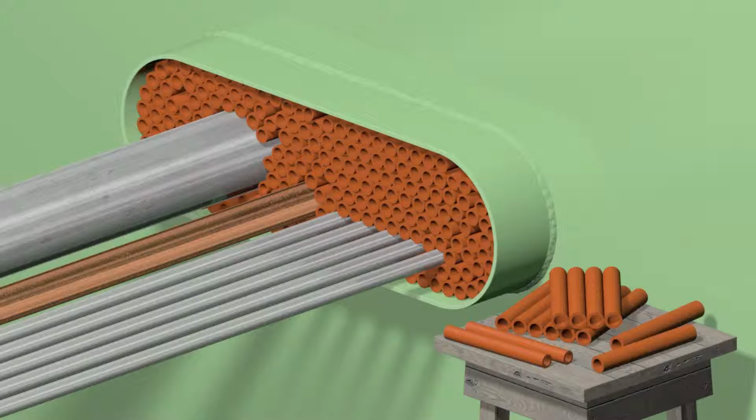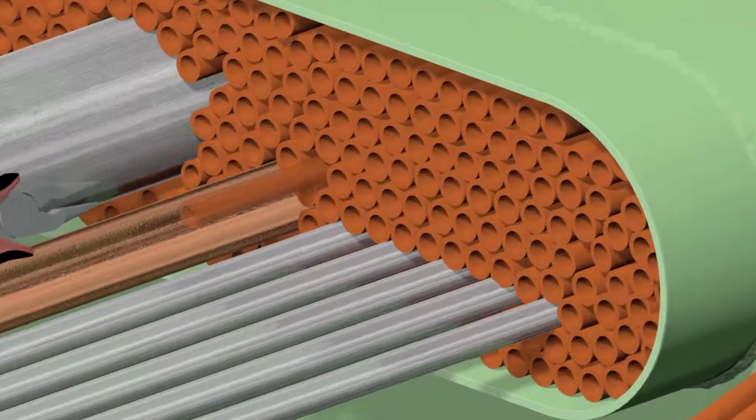Positioning the insert sleeves in the middle of the frame leaves a free space of 20 millimeters at both sides where the sealant will be applied. Use flat nose pliers to insert NOFIRNO single filler sleeves in the remaining smaller open spaces in the set of fillers.